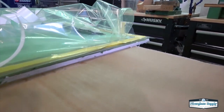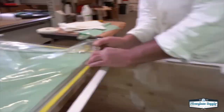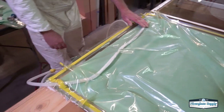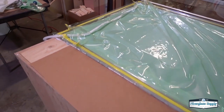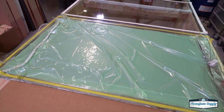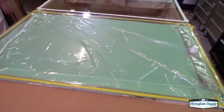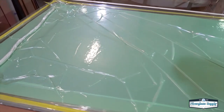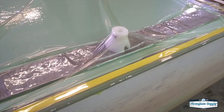Tim's pleating the bag here so that we have enough excess bag to go around our feeds, our vacuum-out, and to make sure the bag is tight around the edges of the laminate stack. If you don't have the bag tight around there, you get a little bridge or gap where the resin can race through, and it won't give you an accurate result. With the MTI hose, because it has that porous membrane, it doesn't allow as much airflow as a regular spiral wrap, so it's going to take longer to evacuate the bag. In some cases we'll use a shop vac to pull the bag down initially, then switch over to the pump, or run a vacuum line through the resin side.